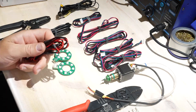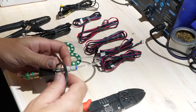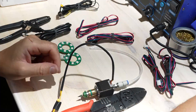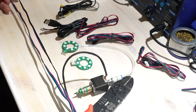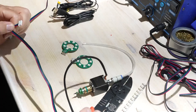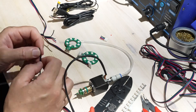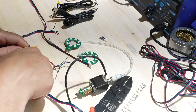Making the wires and pins for my pick and place machine. I explain the full process and share some pitfalls to avoid when wiring and creating pin connection headers. I didn't make all the wiring from scratch — some cables only needed one side modified, while others we had to build completely from scratch. In many cases we clipped the original connector and replaced it with an HSG connector to ensure a secure fit to the motherboard.